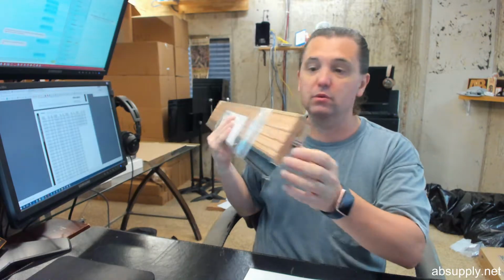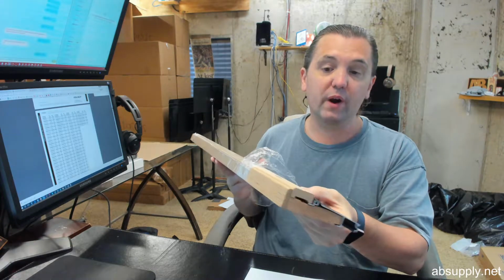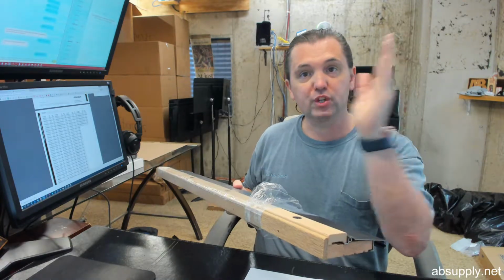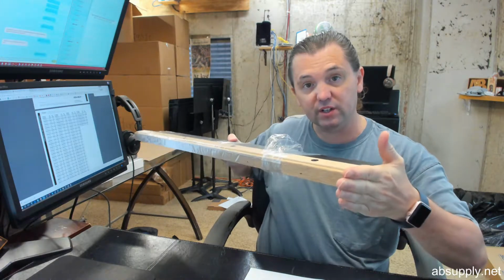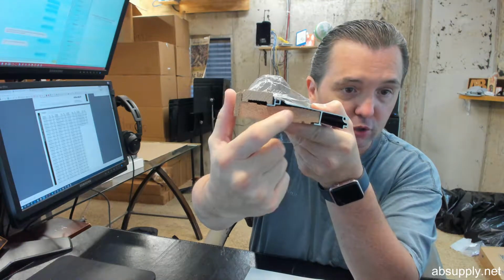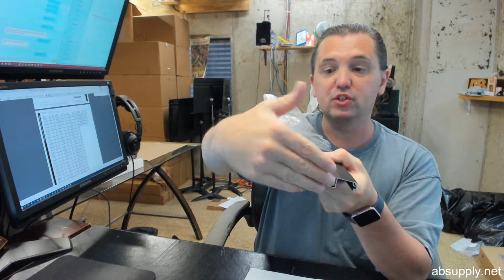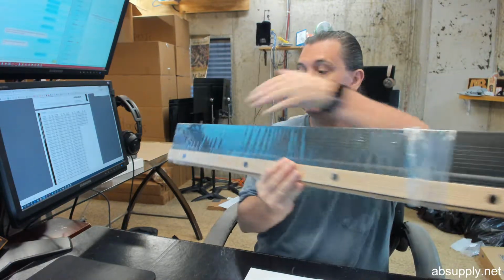These, again, are designed for the pre-hung door market, and as a result, because of how they're installed, they're provided without any preparations for screws. They're provided without any fasteners because these are intended to be an integral component of the overall frame structure, where you are going to have your 2 jambs and your header, and then the sill is literally connected between there and physically fastened through the jambs, and that's what this wood portion down here is partially for. You will screw or staple the jambs right to the end of the threshold, and as a result, up here there will be nothing.